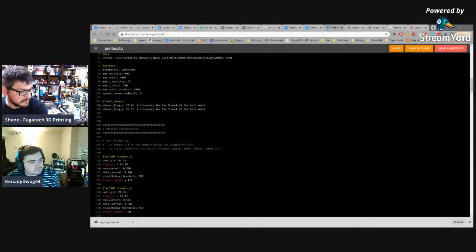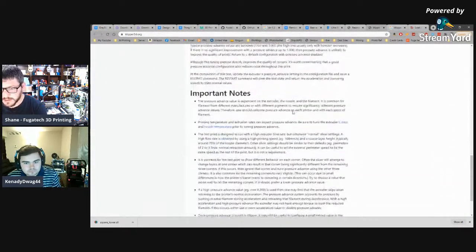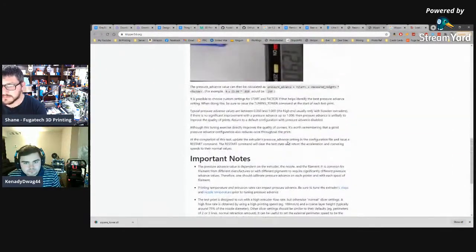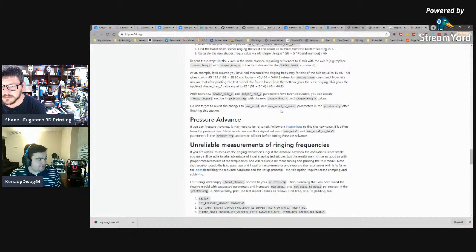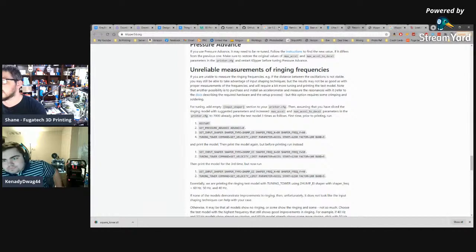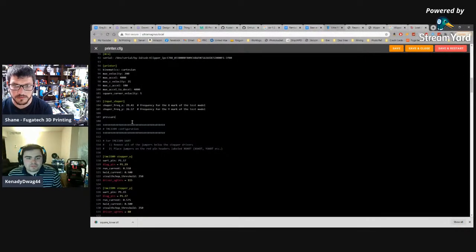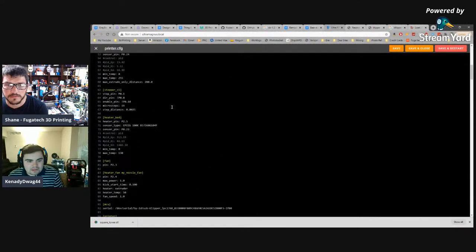All right, so let's go back. I'm going to pull the screen up so people can see this. And we're going to go back to here. I don't think it shows it in there. You're just going to have to go to your config and add it manually. And it's just pressure_advance. So you need to go to your extruder section.